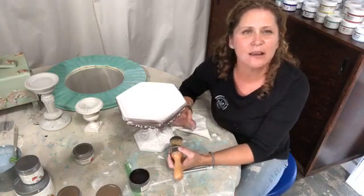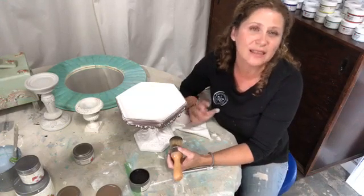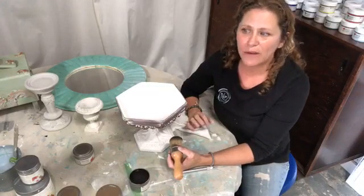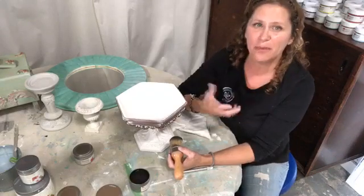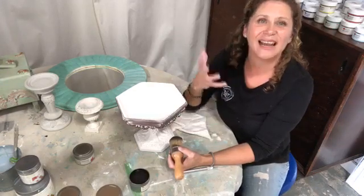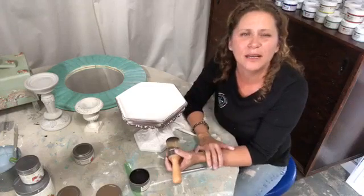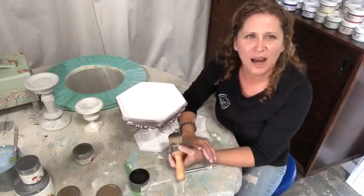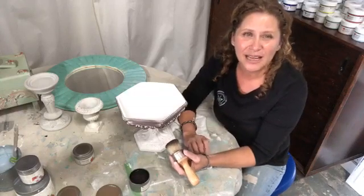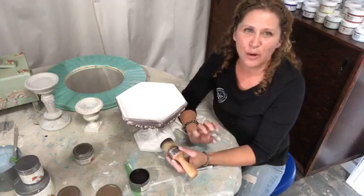But if it doesn't have any kind of sealer, if it's just painting it, check to see if it's already with a sealer. If it is, then you probably don't need to put anything anyway. The wax works for a sealer, and then for any crevices, which is what I'm showing you now, to bring out depth, you probably want to put it in those particular areas if it's been spray painted, to give it that extra look in that particular area, and that's it. And I don't see why it would be a problem. But I would double check what finish it has. If it's a matte finish, it'll probably work a lot better than some kind of a very shiny sealer before putting wax on.